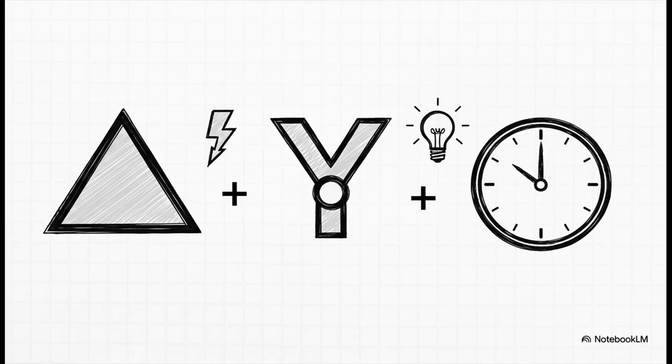And this diagram breaks it down beautifully. The D is for a delta connection, which looks like a triangle on the high voltage side. The Y is for a star connection on the low voltage side, which gives us that all-important neutral point N that every building needs. And the 11? That just describes the timing difference between them, just like the hands on a clock at 11. It's a simple, elegant code that makes sure everything works together perfectly.